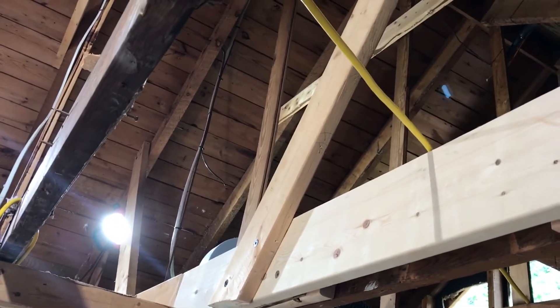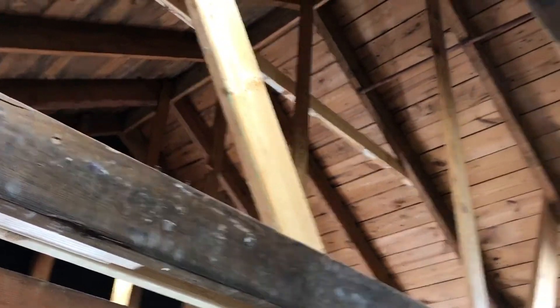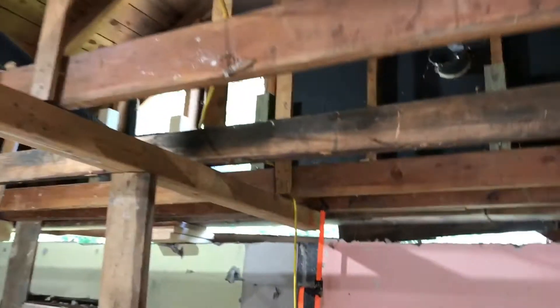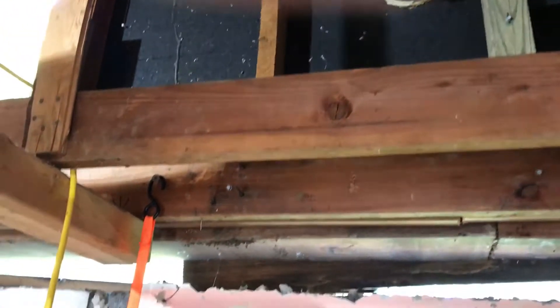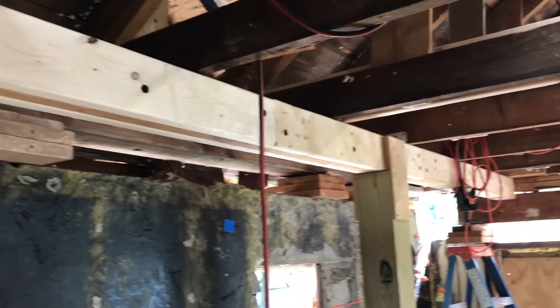We've done a lot of bracing here. We built trusses to strengthen the roof — we've got two of those — and we put some temporary 2x4 rafter ties up there just to give it a little lateral strength. We reinforced both gable ends by screwing some 4x4s onto those jack studs, and those connect to the sill below. We doubled up the rim joists on both gable ends, and then we built three 20-foot beams — built-up beams, triple 2x6s — that span all of the ceiling joists.